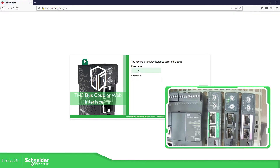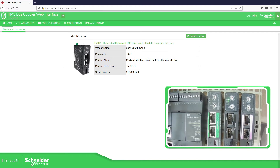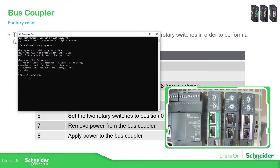The username I haven't changed — this is 'administrator' — but I have changed the password. So I'm going to show you that now. Using administrator login, I'm going to use 'automation' as the password. As you can see, I'm able to enter into the device. So if we perform a factory reset, in order to enter again into the device configuration we should use 'administrator' / 'administrator' and all the settings will be back to normal. Let's close this for now.